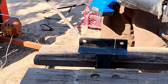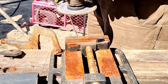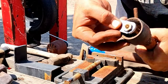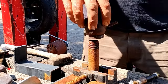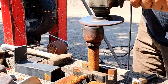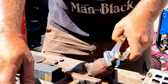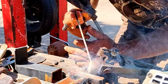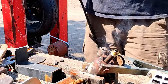It may surprise you to know that I didn't need that entire piece of angle iron — I only needed the hole. This was gonna be the brace for my burner that was gonna allow oxygen to get in and mix up with the propane and give me the right color flame. Now I don't know if you can tell or not, but that pipe is a little off center — I did that on purpose, because as the weld cools it's gonna move right into place. You know how I knew it would do that? Magic!